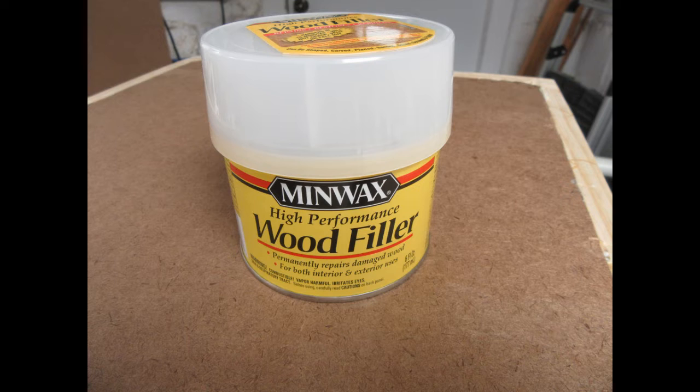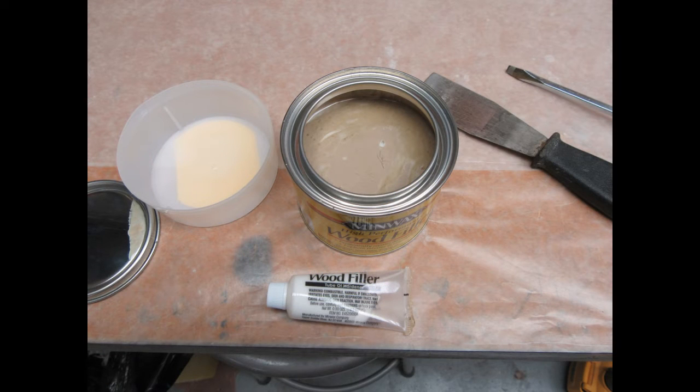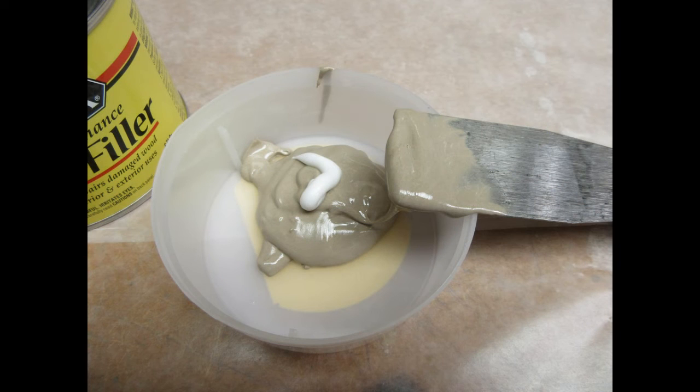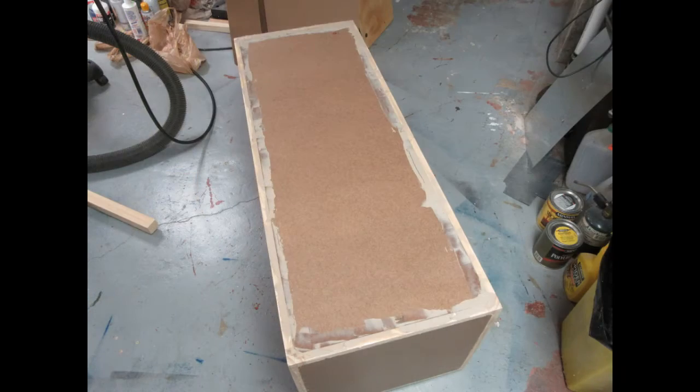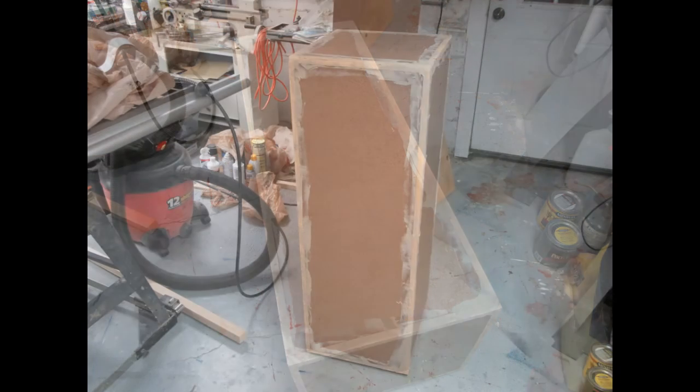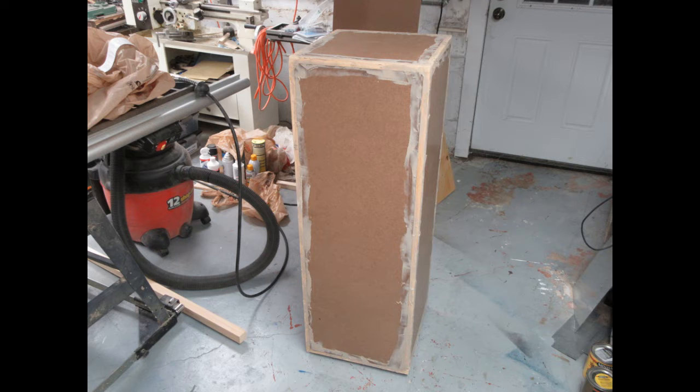I have found that this particular epoxy wood filler product works well for this purpose. This is a two-part product, and once the hardener is mixed with the resin, it begins to set up quickly. So I only make small batches, enough to do one side of the frame at a time. Application is done with a putty knife. Here all gaps have been filled on one side of the case. Here all 6 sides have been treated with the filler.